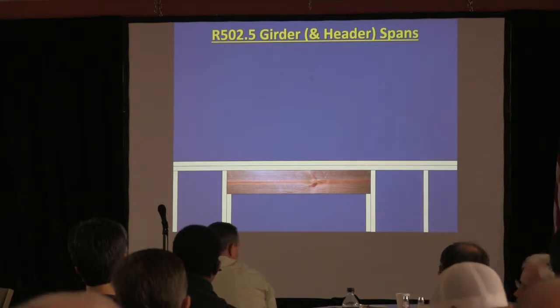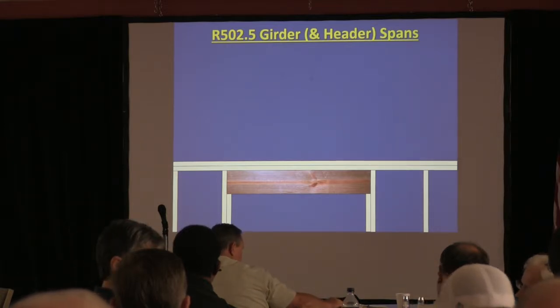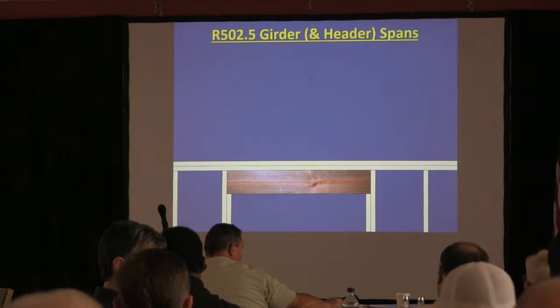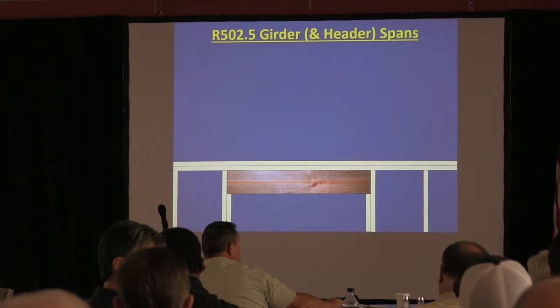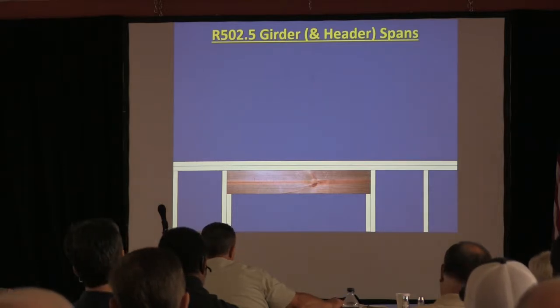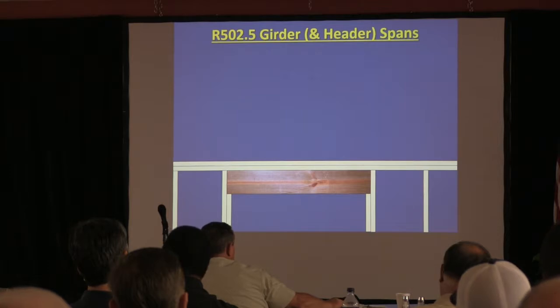Yeah, Chris, I was going to mention to you, there's one builder in town who, a lot of them have had a lot of copper stolen, so they were trying to alleviate the copper being stolen. They were trying to run a chase, a PVC pipe, through the exterior wall to run the line set for the air conditioner, but the wall wasn't thick enough. You have to go to a 2x8 wall to get it thick enough to put the line set through the 3-inch pipe, so it wouldn't work. Oh, interesting. They tried it. Wow. Yeah, that's a big problem in town.